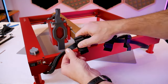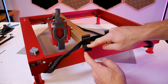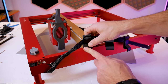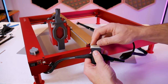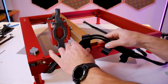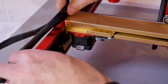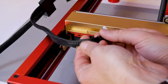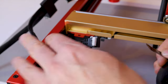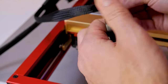Now work on the position of the first one so that the wire harness bends naturally up and into that stanchion. Keep watching because in a moment I'll give you some reference measurements so you can replicate exactly what I've done here. Now that I'm happy with the position I'll remove the double-sided tape from the bottom of the stanchion and it should fit snugly directly onto the corner of the frame member. Press the tape down in place for maximum adhesion, and before we attach the other two we're going to take care of the connection over at the stepper motor. This portion of the harness is going to get held in place using one of the original mounting hole locations for the cable ties, and I'm going to wrap some electrical tape around the end of this harness for a little extra protection.